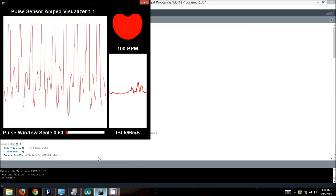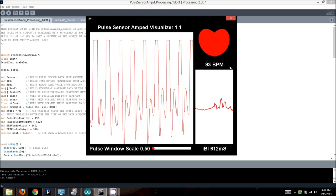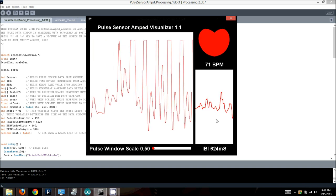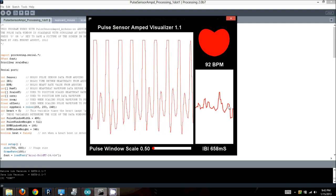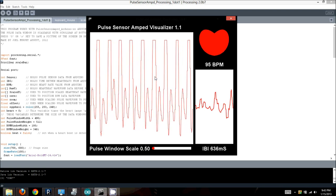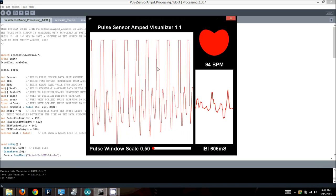So this sensor is actually connected to my fingertip right now, and you can see it's reading a heart rate at 93 beats per minute, 94, and climbing. As I talk about it, it's just going to keep climbing. If you look down here at the IBI, you can see the inter-beat interval and tell the change in heart rate over time. Over here is the actual waveform of the heart rate. Right now my hand is perfectly still, so all of these climbs and drops in heart rate are real — but not a sensor issue.